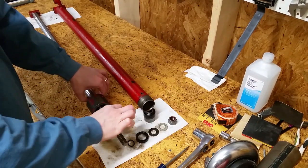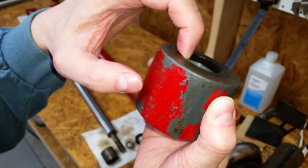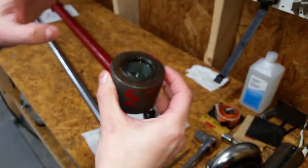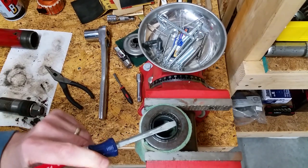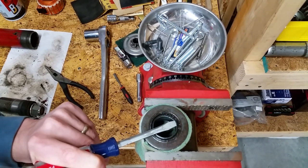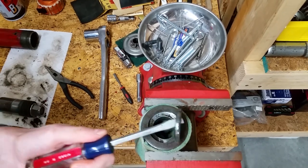Pull the bushing off the rod and slide off the cap. The rod wiper is just a standard oil seal pressed into the cap. Use a hammer to drive the blade of a flathead screwdriver under the edge of the oil seal, then just give the handle a few taps to pop out the old seal.